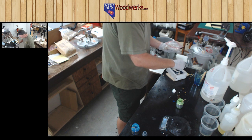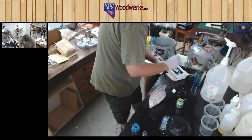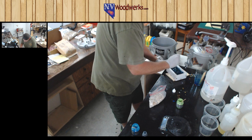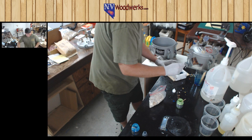And then with something like this, I'm going to cast this at 70 psi. Again, I use CA Technologies pressure pots, and they have a higher max psi rating than Harbor Freight. I don't go over 50 in the Harbor Freights. Now that seems pretty well packed in there. The resin, I think, is starting to set up, so we're going to put it in.